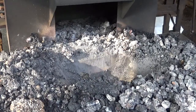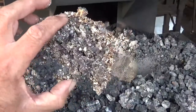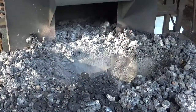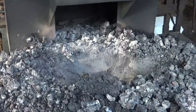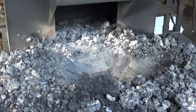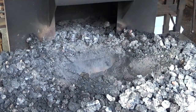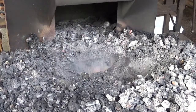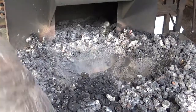First, you want to rake out the fire pot. You want to get all the debris, ash, clinkers, this stuff, big old nasty clinkers. Fire scale from the steel, don't want that in there. Now that we've got everything raked out, we're going to get rid of some of this junk out of the way. And then we're going to start with a little paper.